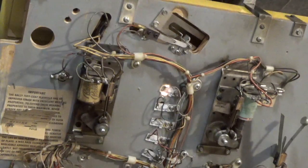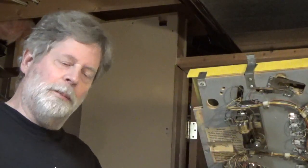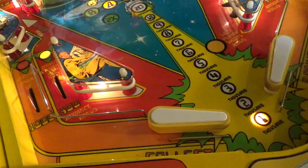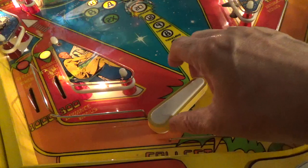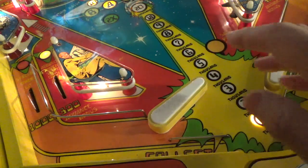But if it's turned off, why doesn't it fall down until we release the button? That's because a flipper coil has two magnets in it — a strong one to pull the flipper up firmly and send the ball flying, and a weaker one to hold it up. When it hits the cutoff switch, it only turns off the strong magnet. I say it's a weak magnet but it's actually fairly strong. If you press the button to raise the flipper and try to pull it down against the magnet, you'll see what I mean — you probably could pull it back down, but please don't. You don't want to break anything.